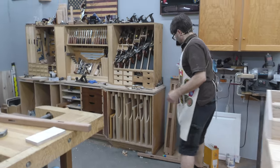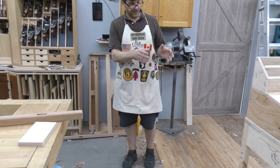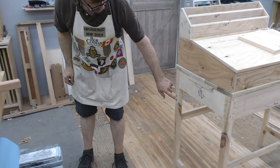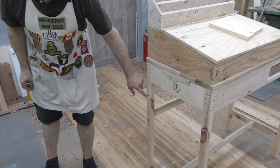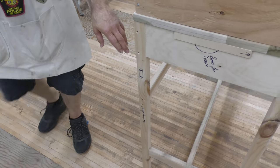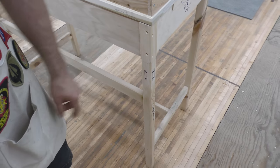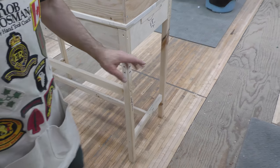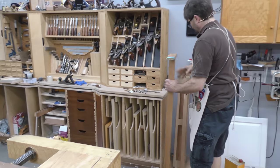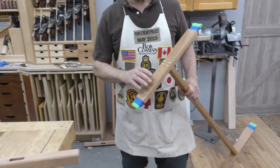Oh, by the way, once we've got this designed and we've figured it all out, and we go through the details of actually drawing in what the through wedge tenon will look like so that we can determine what size we want it to be. At first, we thought we were going to use just a 3/8 on this cross piece, but it didn't quite look big enough, so then we went with a 1/2 inch, and that's the one we've settled on. So I'll show you both, and we do this on our online workshop, so it takes a while because we film 3 45-minute episodes each week.